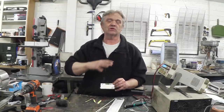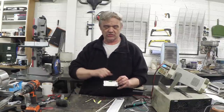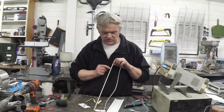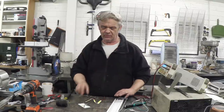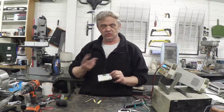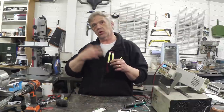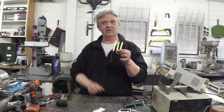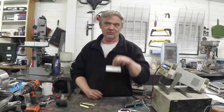When putting power into an LED we don't want too much or we'll blow it up. But when we want power out, we don't want that resistor. So I've snipped it — positive here, negative here. These ones are meant to run on mains with tiny groups of LEDs and resistors, which is going to be an absolute pain to work with. For that kind you need to identify and snip the resistor. With COBs, they come with no current limiting at all — you add your own — but they come with just a black and a red wire, so they're dirt cheap and dead easy to use.